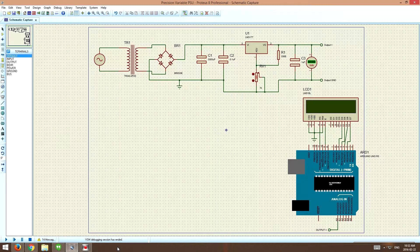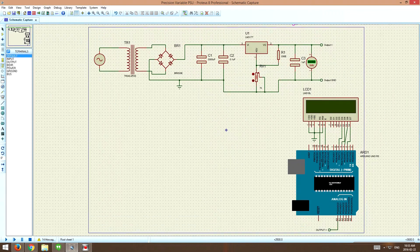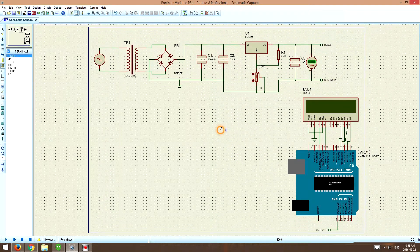Now, just to show you guys the basics of a simple zero to five volt voltmeter — no voltage dividers, unlike the circuit you saw on the breadboard. Here I've simulated the bare basics for you guys to play with. We've got a very basic LM317 power supply with a zero to five volt output range. We've got the LCD panel connected to the Arduino, and we've got the output over here. The output positive is connected to output positive, and they share a common ground — the Arduino will be on the same common ground. The software for this one is even simpler than previous units.